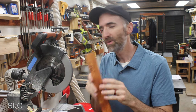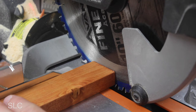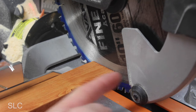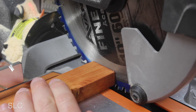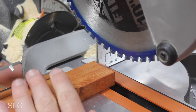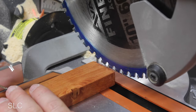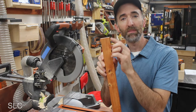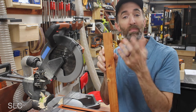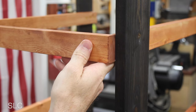That can be really hard to do, so I'm going to show you a little trick on a miter saw to make it really easy. Bring your miter saw all the way to the down position, then take your wood and bump it up against the blade, pushing inward on the blade. Once you have that, hold the wood in position so it doesn't move. Lift up on the blade — the blade will straighten out, and as you come back down, it will cut just a very small piece off your wood. You may have to do that a few times to inch up on the exact measurement, but at least you know you're only taking off a minimal amount each time.